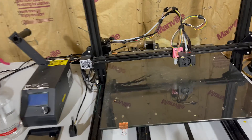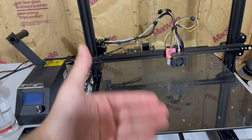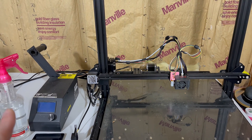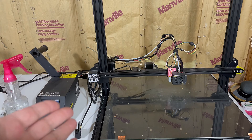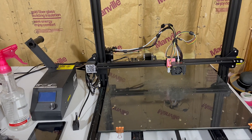On top of that, we had to slow down the print so much because this bed is pure glass with a hunk of metal — about 30 pounds moving back and forth. We have to slow down prints to about 11 to 15 millimeters a second. Anything faster than that, there's an excessive amount of ringing. And when you're trying to do prints that will be shipped as-is, the details matter. So it was just kind of a waste, to be honest.